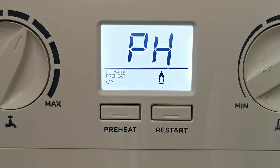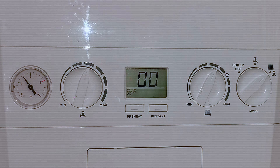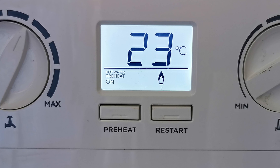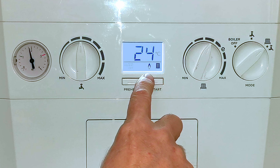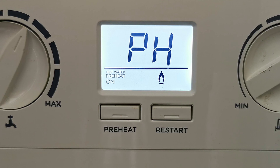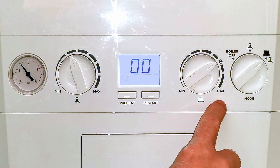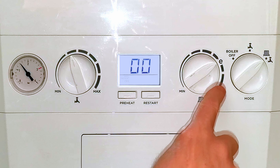There are a couple of occasions where you might like preheat turned on — maybe if you're on a water meter, because the hot water is going to come out of your tap maybe 15 to 30 seconds quicker. Also if your boiler is in an outhouse, a garage, or a loft where it gets really cold, but bear in mind the boiler will cool down faster and the preheat will come on more often, using more gas. One thing to note: if your central heating is on, that's exactly the same as having preheat on, so if you only use hot water when the central heating is on, you should definitely have preheat turned off.